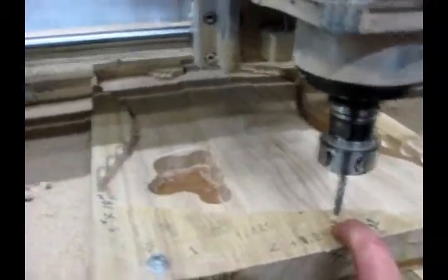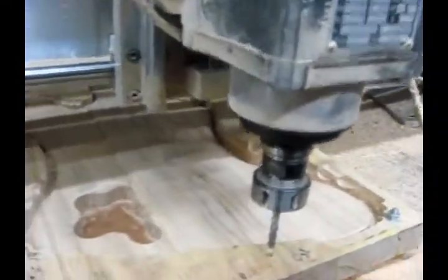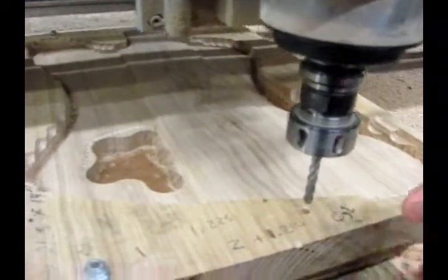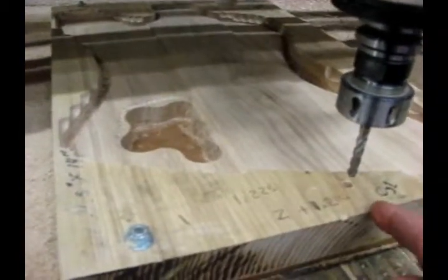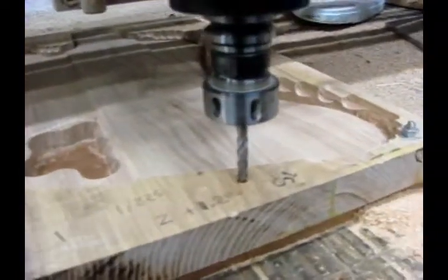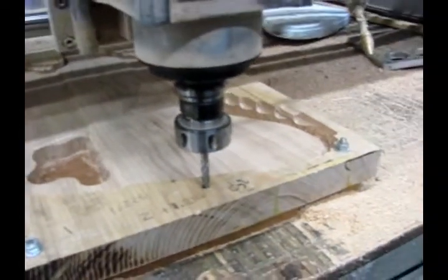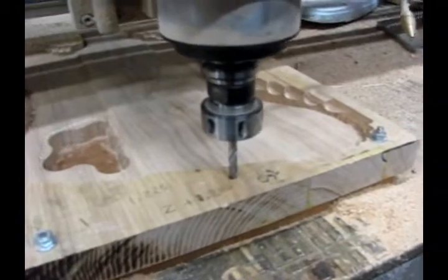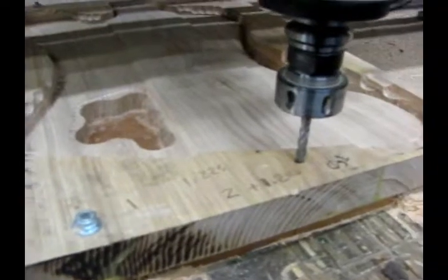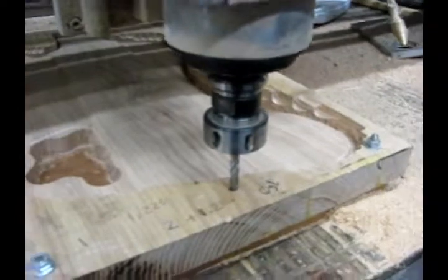Make a reference hole in your project so you can shut the machine off at night. I park it in the reference hole and the hole is at zero in X and one in Y. I finished its job and told it to go back to zero, one — and it never lost any steps. If you leave your machine parked in its reference hole when you turn the power off, you turn it back on in the morning and set that number back to zero, one, then you go right from there.